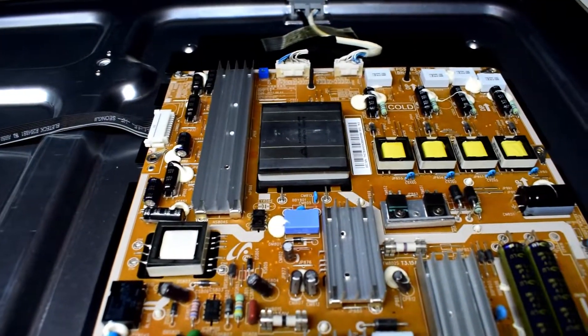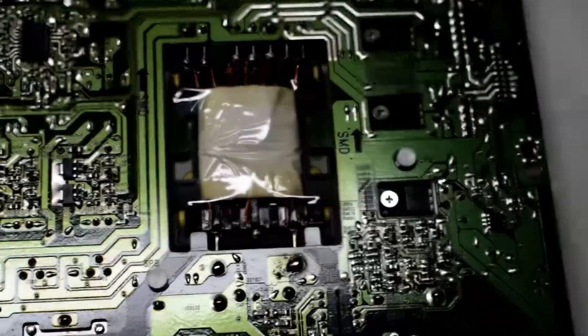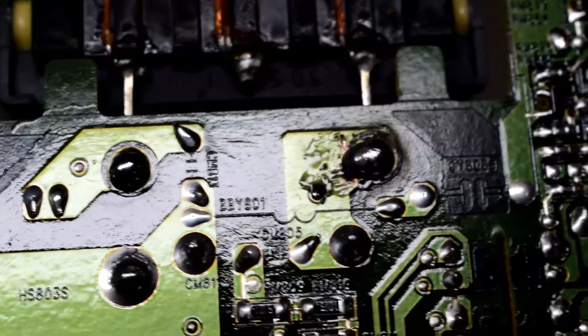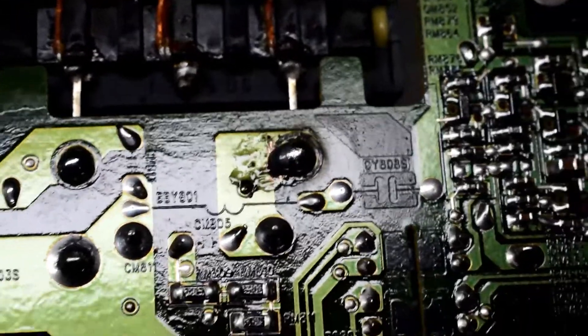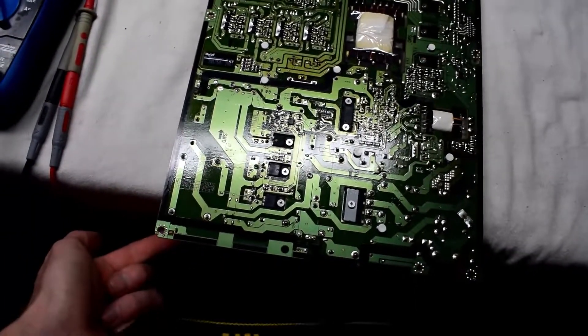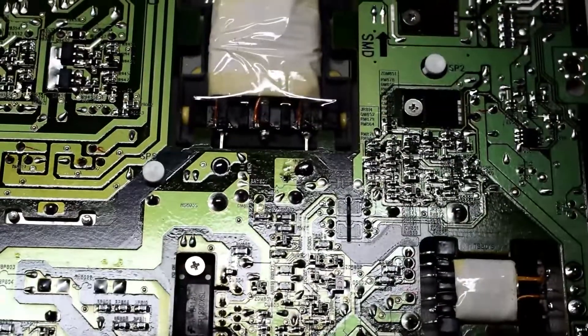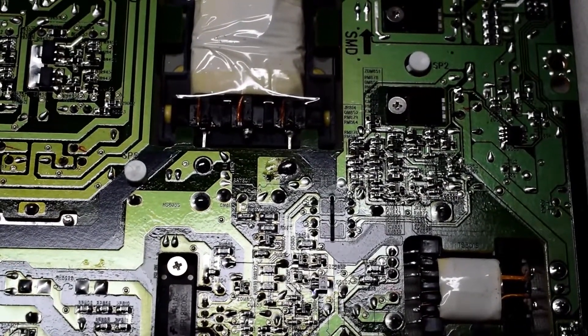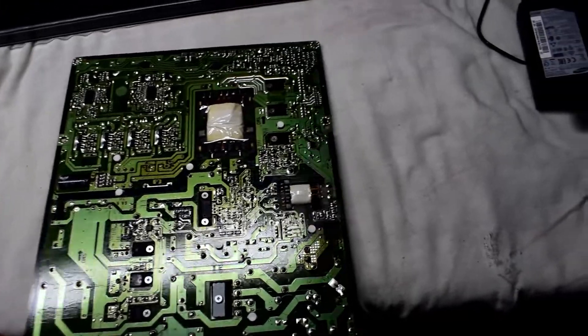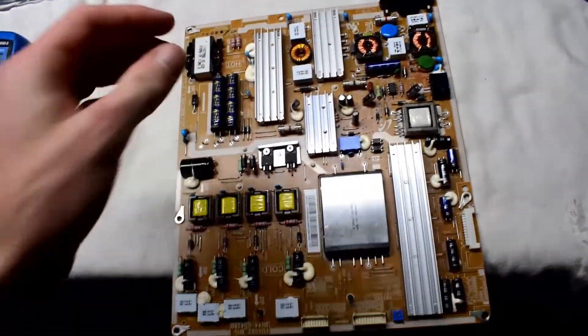If you take it off, here's the transformer — you can see this was burnt around the contact on the PCB. I resoldered that. The reason I knew that was the issue is because I plugged it in without anything connected and saw some sparks right on that joint. So I resoldered it, plugged it back in, and it was working like a charm.